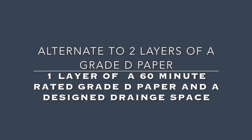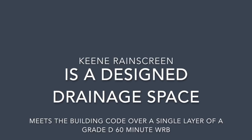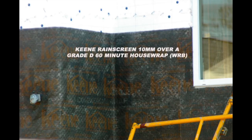As discussed previously, not all WRBs are made the same. If we have a Grade D 60-minute rated building material — house wrap or equivalent — and we separate the water-resistant barrier from the stucco with a designed drainage base such as Keen Building Products Rain Screen, we then only need one layer of a 60-minute water-resistant house wrap or building paper. Keen Rain Screen is an entangled net material with a fabric over top to stop the mortar from filling the cavity. The open cavity created will allow for enhanced drainage and ventilation, allowing our wall system to dry properly.